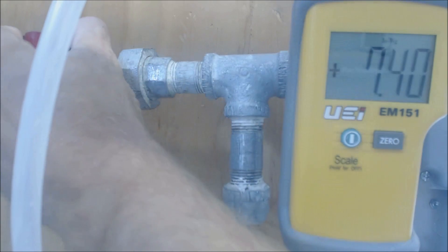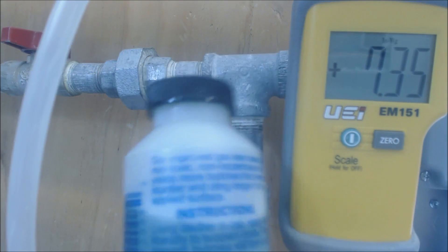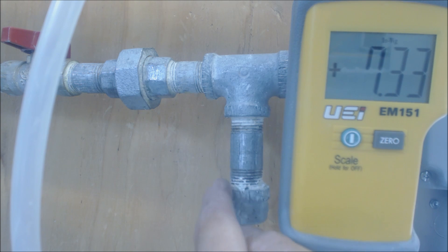You just go ahead and turn this back off, take that off, and put on the new cap. You're going to wipe off the excess thread seal before you leak test it with your bubble leak detector. Make sure you do not use dish detergent and water like soapy bubbles because that will corrode the pipe, especially in the case of CSST — corrugated stainless steel tubing. Make sure you're using something non-corrosive like a dabber bottle with non-corrosive bubble leak detector. I always use the super blue micron bubble leak detector — it tends to stay on the threads longer.